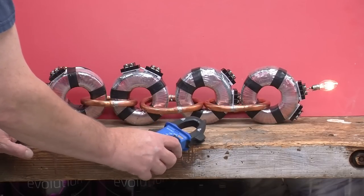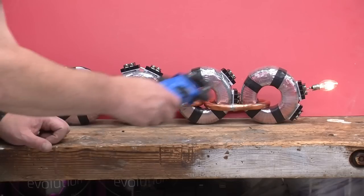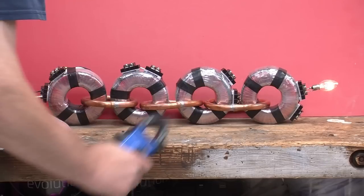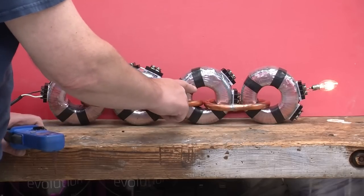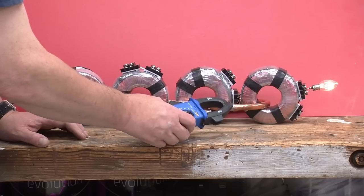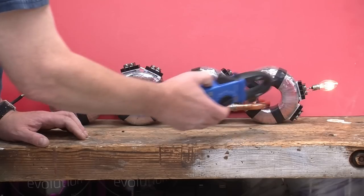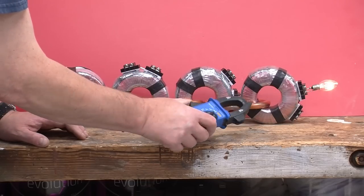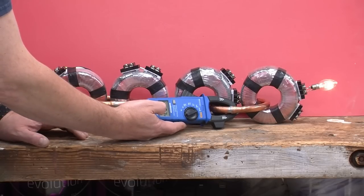So the first interesting thing we should do is take a look at the currents through our one-turn coils. To put things in perspective, that's a seven watt light bulb, maybe five watts, and it probably uses a few tens of milliamps. So how many amps do you think would be traveling through these electric one-turn coils? Well, if the regular transformer equation is to be believed, and we have 500 turns powering this light bulb, the current in a single turn should be 500 times that current. There you have it — about 23 amps, which is quite a bit.